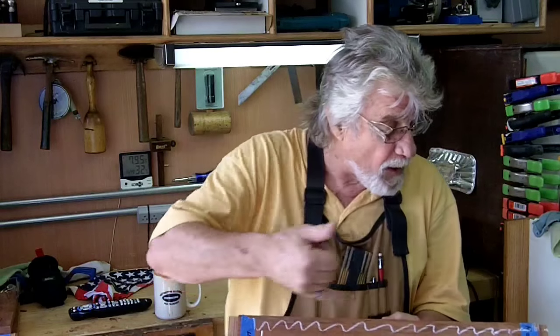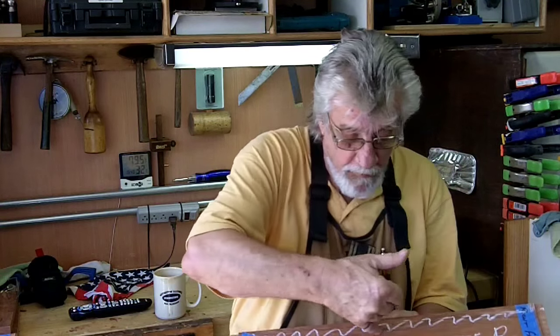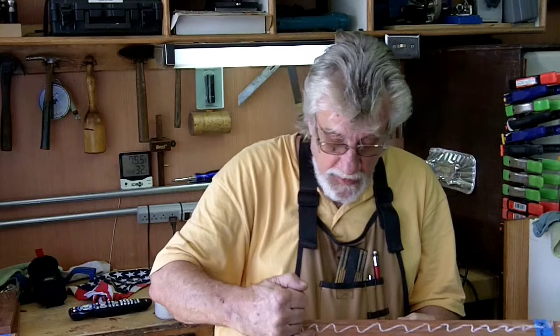It's going to be a small drawer. The way I'm going to do it is I'm going to use this and cut the drawer front out. I'm going to cut an inch off right here off the top, and then cut it right here — so this will be the drawer, this will be glued back on. This is an eighth inch wider than all the others, so when I make my rip and glue it back together it should come out even with the others.